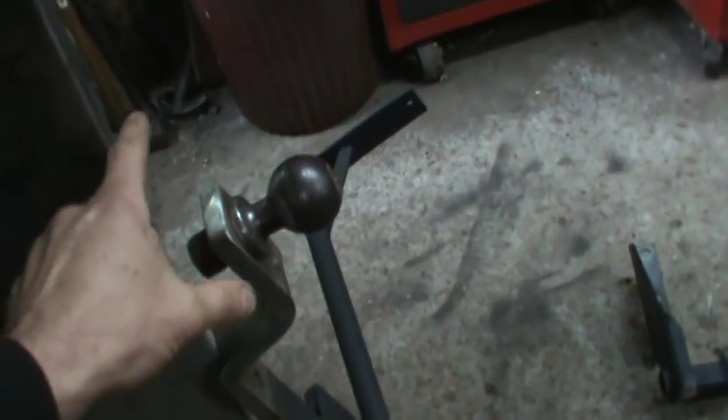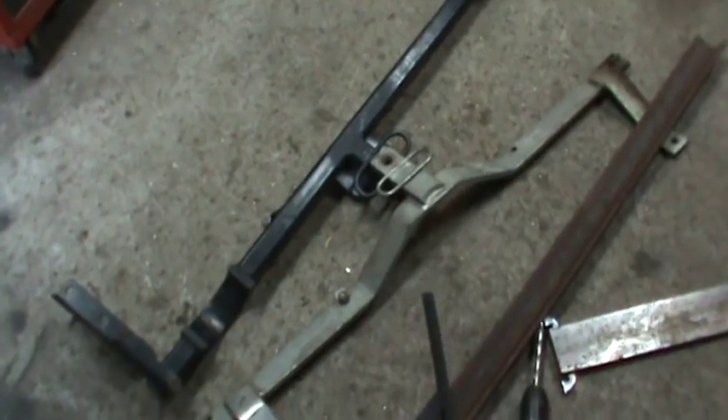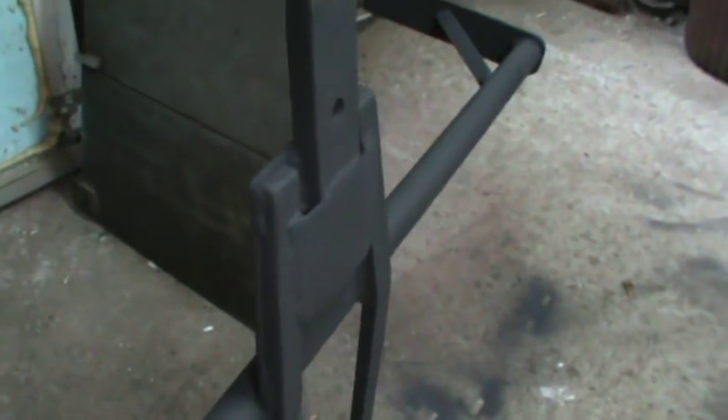So I heated and bent — that was normally straight right there. Heated that, kicked it in. These are all just separate plates that are tacked together, and I made it so I had some more support. This piece had a bend in it — had to heat it up and straighten it out. It was longer, and there was another kind of knuckle that came off of it. Drilled that out. Everything is just welded together with a flux core welder. They do pretty good, especially when you're working on the thicker stuff. I added another plate under there to kind of help tie it all together. That's going on in a few minutes after we're done with this video.